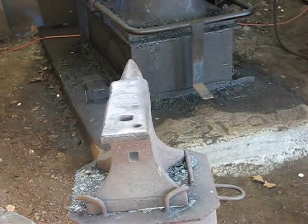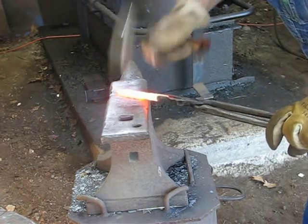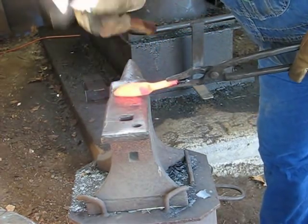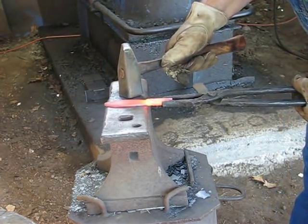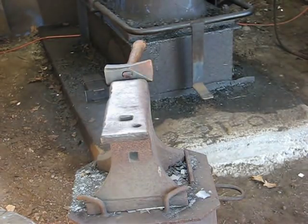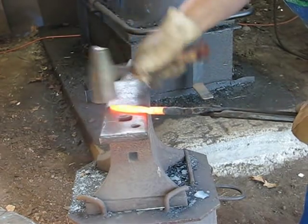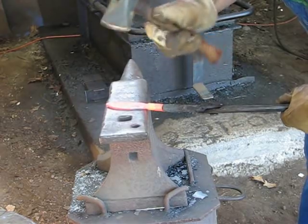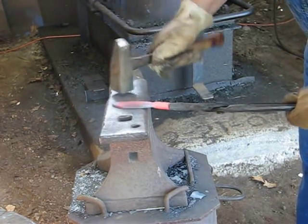As you noticed I grip it with two sets of tongs and that enables me to control it a whole lot better. Go ahead and forge a little bit more shape until you get it pretty well close to the shape that you need. If you need to, turn the hammer over and you can spread out the part of the bottom of the edge a little bit. This hammer that I'm using is one that Butch Seeley made for me and it's got a diagonal cross pin. It works really good in getting this edge on down. When you turn it over, it spreads that edge on down a little bit, and flip it back over to the flat side and that gets it back flat. I really do like his little hammer.